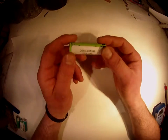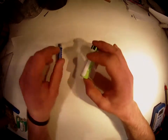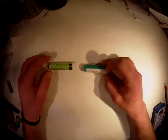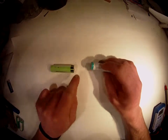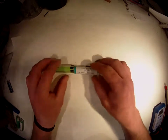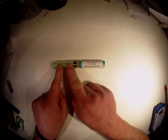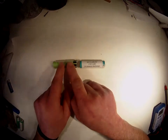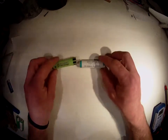Then, how is it possible to connect more of these together? Well, you have two options. First, you can put them in series. That means the negative there, plus there, negative there, plus there. As I told you, each cell is 3.7 volt nominal voltage. This should be around 4 volts now, because it's slightly discharged, and this one should be about the same.